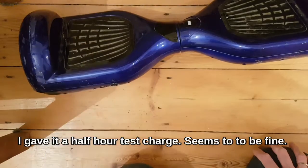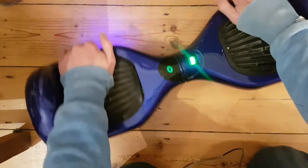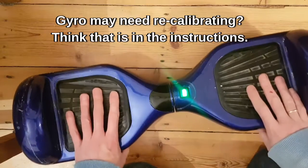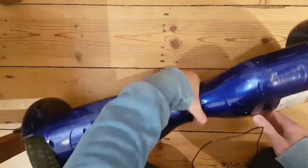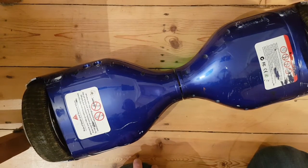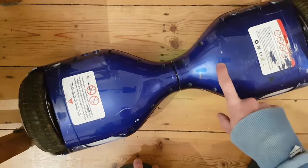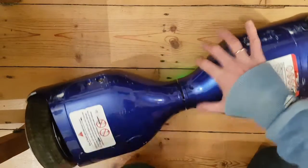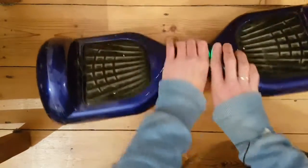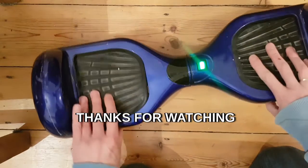It's had half an hour of charge — quick power up, it's taking a charge. You can see that side goes forward, that side goes forward, that side goes back, that side goes back. So that's fixed. All it was was a screw — the wheel had come loose, the rocking eventually loosened a screw on the gyro board, that screw worked its way under the main board, shorted out the main power rail, and blew a transistor. On top of that there was chewing gum in the wheel making it stick and bind. If you think you're going to get a demo of me standing on this, you've got another thing coming. Thanks for watching, take care, see you all later — cheers, bye!